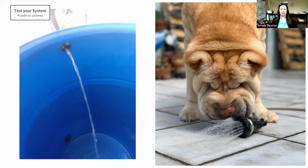What I do is I take my hose and water the roof line above my barrel. That is where the water will come into your barrel. If you have a barrel where you can remove the top, then you can see the water coming in. Otherwise, you can just hear it. You can get a flashlight and look in your barrel through the two screw caps, or you can just listen for it. That's making sure that everything was done correctly and that the water is going into the barrel like it should.